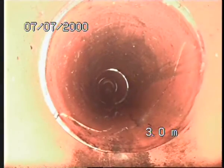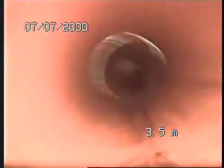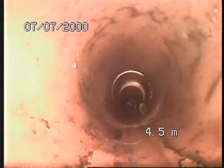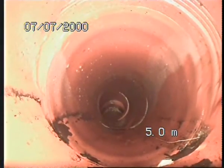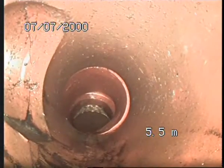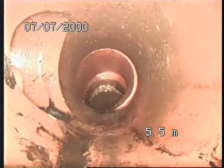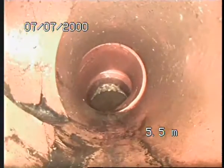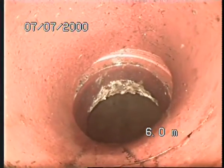There's a little bit of self-silting still here. There's definitely a crack there, and some displacement — you can see. It's got a lateral and the lateral is cracked; it's on the left-hand side. And then inside the 100mm pipe you can see this crack there, and it goes into the main.